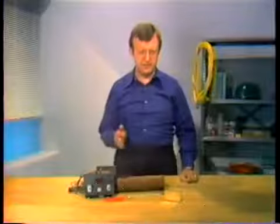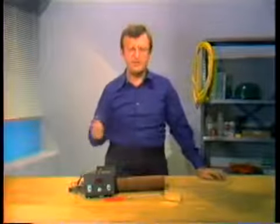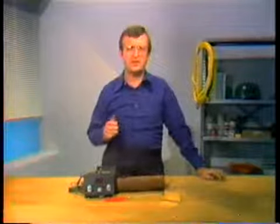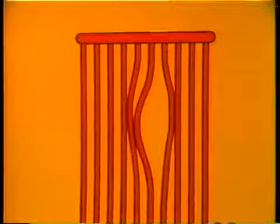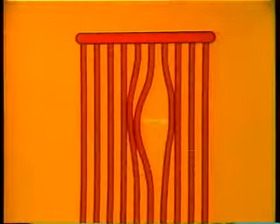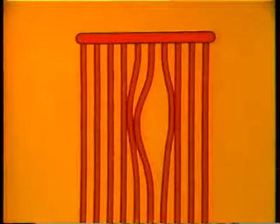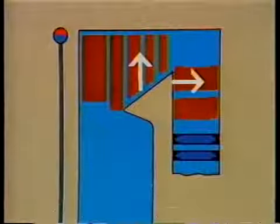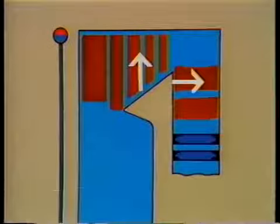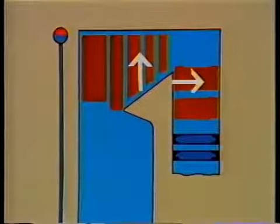There's another group of problems in the superheaters and reheaters that's common to all metal boiler components. This group includes erosion, corrosion, cracking, problems in areas of prior repairs, problems with construction welds, and leakage. Accelerated erosion is caused by warping and ash blockage. Erosion is therefore most likely to appear where gas flow is particularly rapid or where ash concentration in the gas flow is particularly heavy. Ash concentration may be heavy where gas flow makes a turn. Tubes at the outside of the turn are especially vulnerable to ash erosion because there the gas flows faster and loose particles tend to become more dense and abrasive.